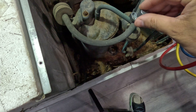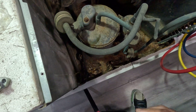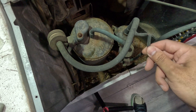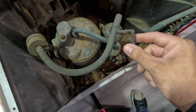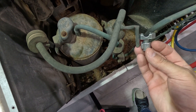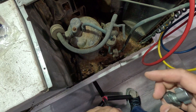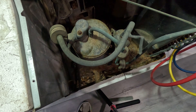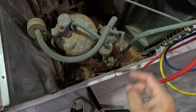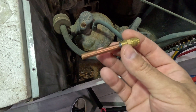You can install this piercing valve anywhere on the unit where the big pipe is. The easiest place would be right here. When the manufacturer installed the compressor, this is actually where they installed the freon — but they have a special tool to crimp it and then take out the access. This is what's called a sealed system. The only way you can add freon or refrigerant to this unit now is by installing one of these piercing valves, because the manufacturer has sealed it off.